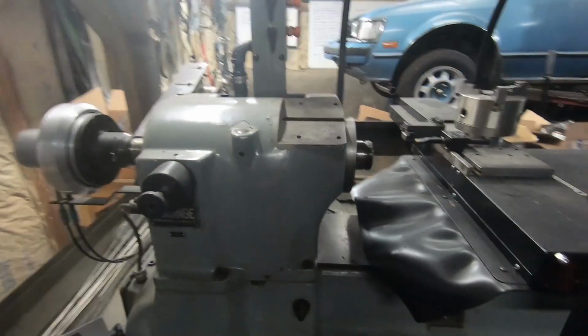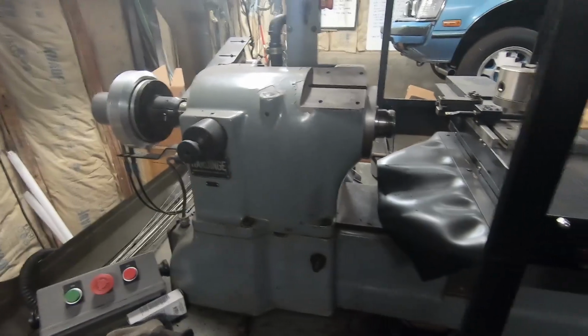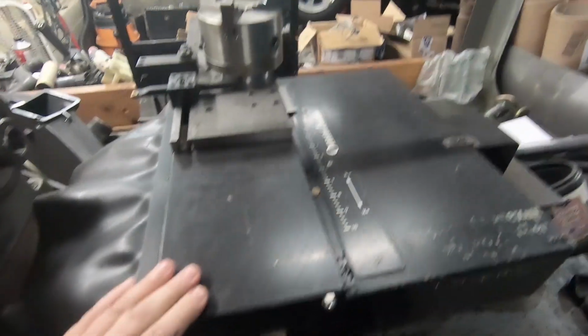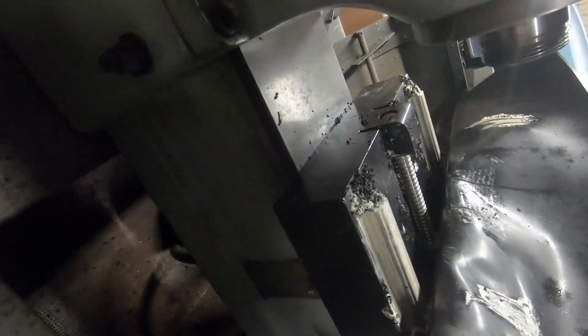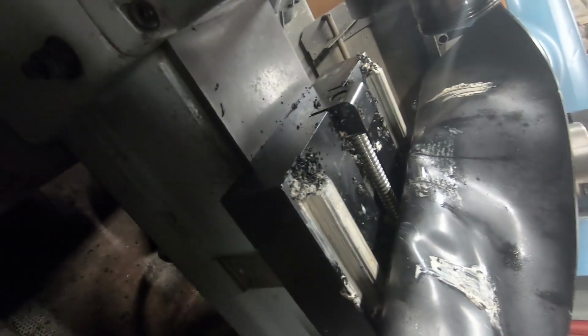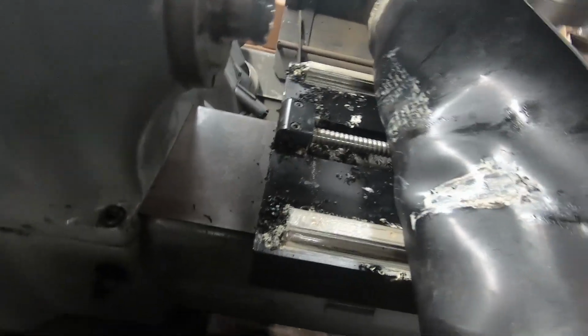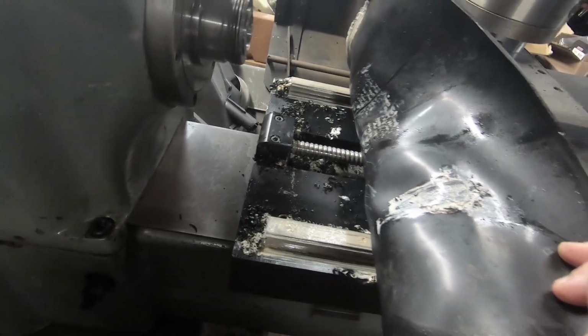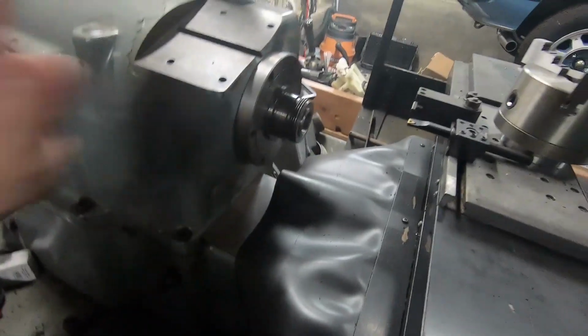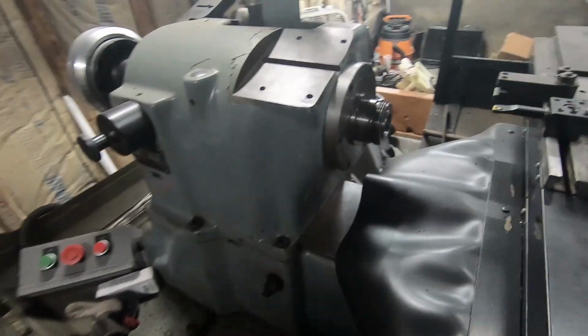Okay, the lathe itself is like a 1980 Hardinge lathe. And this is 5 horsepower. It's got a coolant tank, but it has what's called an OmniTurn attachment. And what this attachment does, like our other machine, it too uses a rigid base plate, only this one bolts to the actual bed, the original bed. You take the carriage off the Hardinge lathe, and this bolts to the bed. But it's got the ground ball screws and the good Rexroth or NSK linear ways, all the good stuff. These Hardinge lathes are so incredibly precise, the tolerance on them is one of the most precise lathes in the world.